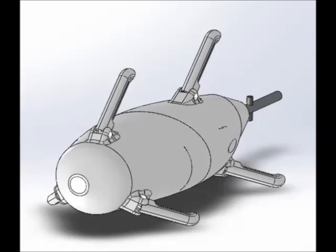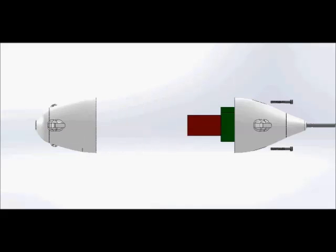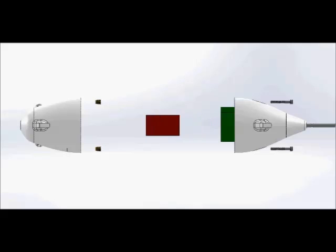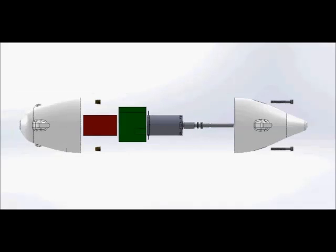drivetrain design. With an integrated waterproof external shell, it can be easily taken apart through the removal of 2 bolts along the parting line. These are attached to the front half through heat-set inserts. The locomotive is powered by a lithium polymer battery, controlled by a custom XBee Arduino stack, and moved through a 12-volt Maxon motor attached directly to the propeller's shaft.